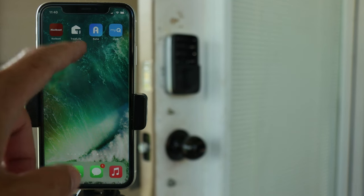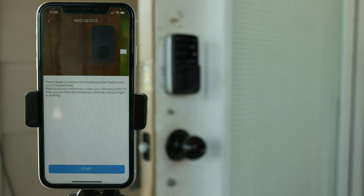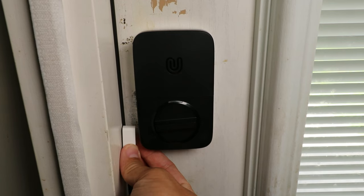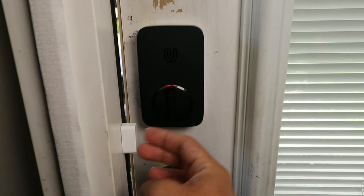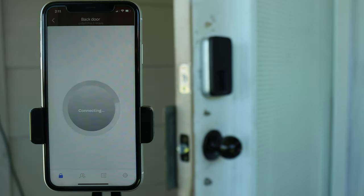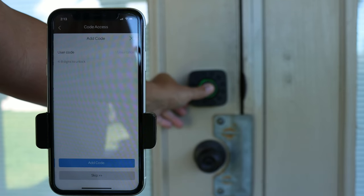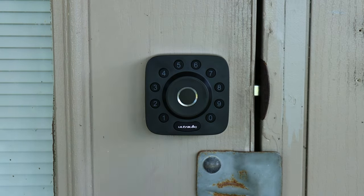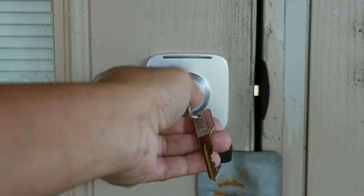Time to set this up — you need to do this using their U-Tech app. Click on U-Bolt Pro Series and insert the batteries. Type in your main code, set the deadbolt position, and add the door sensor, which you need to stick or screw into the inside door jamb on the lower edge of the lock so it will know if the door is open or closed. It has a cover also if you want to put it in. Follow the rest of the instructions to calibrate the lock until it is successfully set up. At this point the lock is a Bluetooth lock, so if you are within Bluetooth range you can see the status of the door and lock in the U-Tech app. Click on it and you can lock and unlock the door. If you add your fingerprint and access code in the U-Tech app while in Bluetooth range, you can unlock using fingerprint, push the Ultralock button to lock, use the keypad with your access code, or open the lock using the backup key slot — though I have some concerns about that which I'll tell you later.